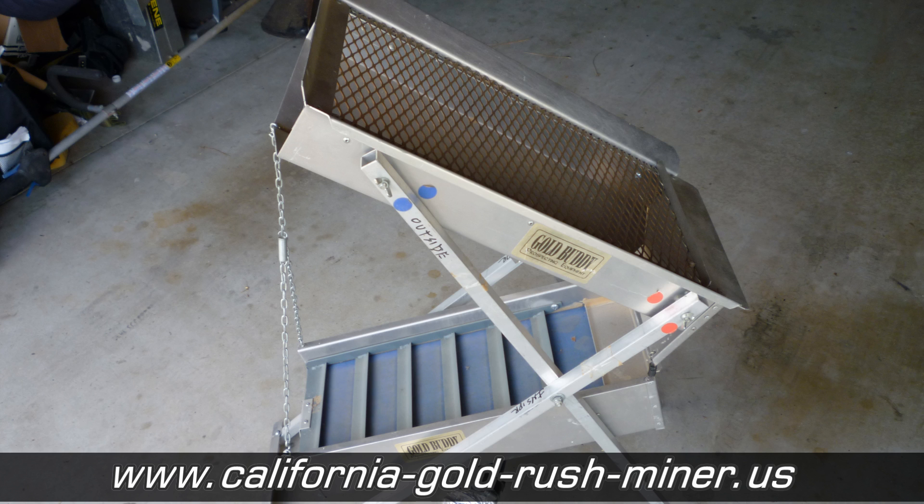You can also set the angle for the bottom box, and the dirt flows through there. At the same time, you have a hose connected to the bottom, and where that connection sets up there's a little propeller that spins around from the air that blows through. That shakes the whole bottom box — it's set up on springs, so it's only attached to the top box on springs. So that's shaking, and the air coming through that porous bottom layer is blowing all the fine dust and dirt off, and you're left with the heavy materials.